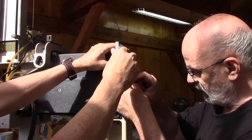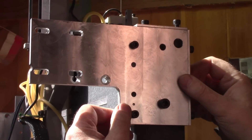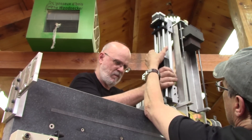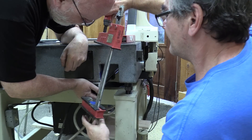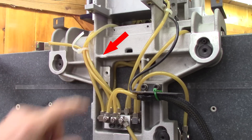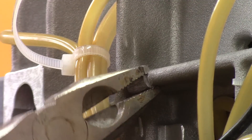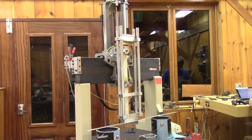After almost a year, Pierre came back to the shop to install all the parts they made. They are machined so they can fit on the already existing anchors of the machine. All of us tried to install the X-screw, but some modifications are needed. Pierre tries to install the bracket he did for the Z-screw, but we're missing some bolts. He decided to glue the brackets he made for the Y — using special epoxy, we glue this under the granite top. Now that I'm alone, I can work on the piece that goes there. Philippe tried to grind part of the metal but this was not enough, so I use a Dremel to make a bigger opening. Now it's possible to put everything in place to move the X-axis, including the ball screw. Finally, I have one axis working.